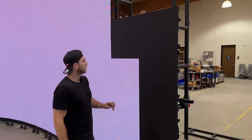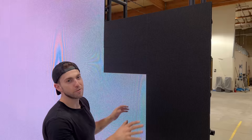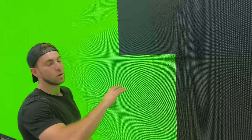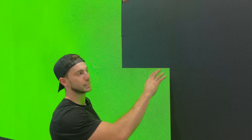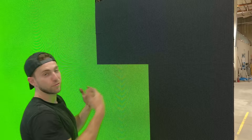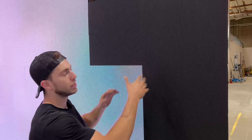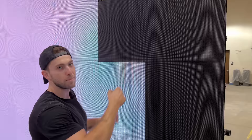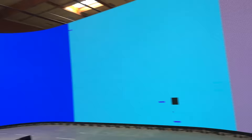As you go all the way up, that's how you build a video wall. After attaching panels, check for imperfections — you can see this panel is popping out, and down here we're lifted up off the panel below, creating a seam. When the wall gets to full white or has content, you really do see these seams, so we need to redo these two panels. The best approach is a two-man crew: one on the front checking seams and lining up panels, one on the back latching everything down. You're in constant communication.